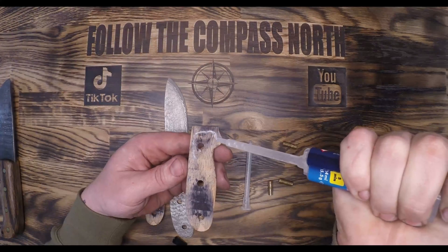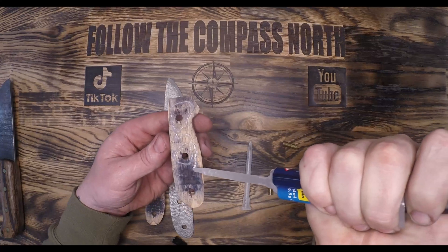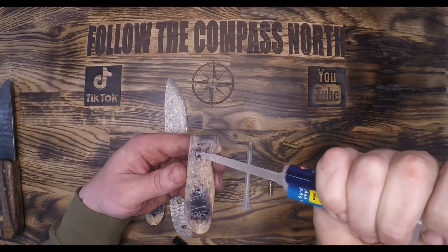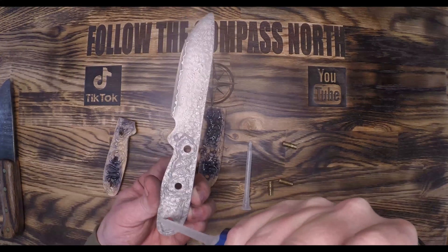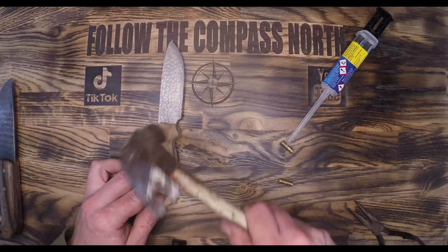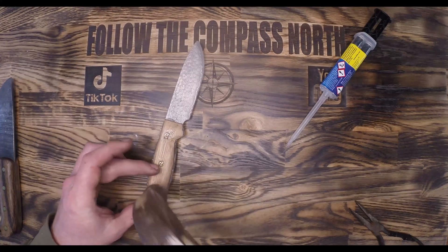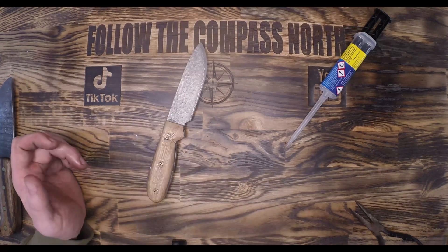I love the way the raindrop turned out, so now it's time to finally glue up the handle permanently instead of doing all this dry fit nonsense. I like to use way too much epoxy because it's a lot easier to wipe it off the outside than it is to add more to the inside. I didn't film the clamping process but the bottom line is you throw two clamps on between the pins — if you throw them on the pins they're just going to put pressure on the brass and not on the handle itself. I recently learned that if you clamp too hard you can actually squeeze out the glue completely and get less of a bonding surface, so clamp with medium to hard but not too hard pressure.